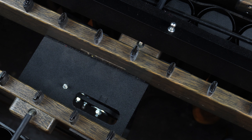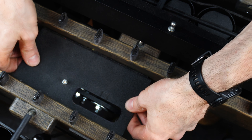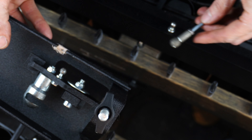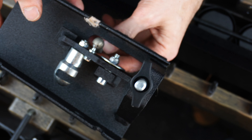To remove the dampener bar, slide out the pin from the top end, then remove the bottom ball socket from inside the dampening mechanism, and slide the low end of the dampener bar off the frame. To remove the other ball socket from the dampener bar simply pull. The dampening mechanism removes easily — release the pull rod from the pedal and then lift straight up. The threaded connection piece connects to the ball stud; slide it from underneath and over the top of the stud, then use a set of pliers to squeeze them together until you hear it click into place.